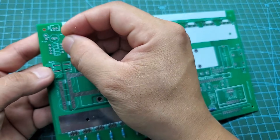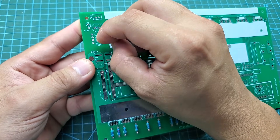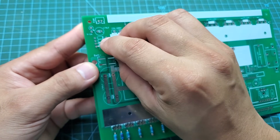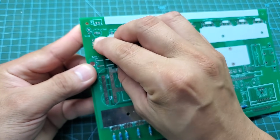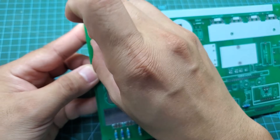I have an auxiliary 12-volt winding from the transformer and use four small diodes to rectify it into 12 volts to power the cooling fan. Whenever the transformer operates, the cooling fan will work as well. I also added a 2.8A fuse to protect the system in case the cooling fan malfunctions, preventing it from damaging the power MOSFETs.